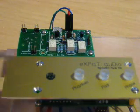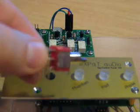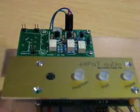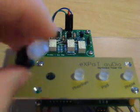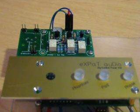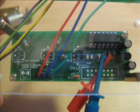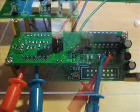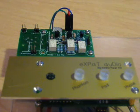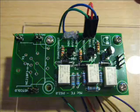This board is designed to replace traditional toggle switches that you'd normally use in your design, by replacing them with small push-to-make switches, which often have an LED inside as well. Push-to-make switches normally require some kind of switch detection and then toggle — that's normally done in a microcontroller. So what you're getting with this board is the board itself, plus the microcontroller from Expat Audio and the three switches. Together, the microcontroller detects a push on the switch and then toggles the last known setting.